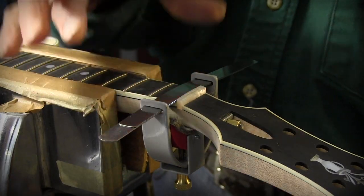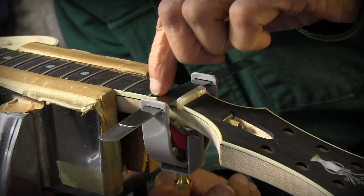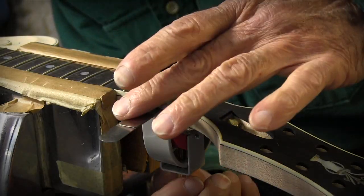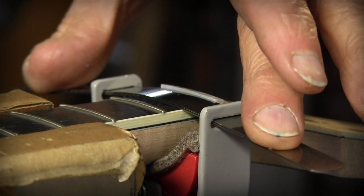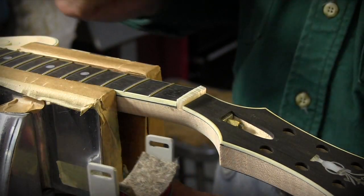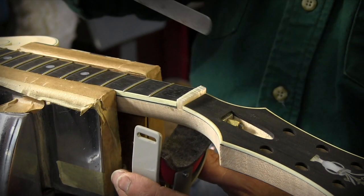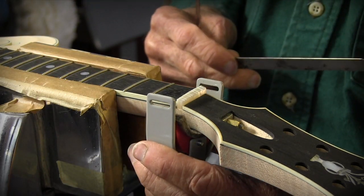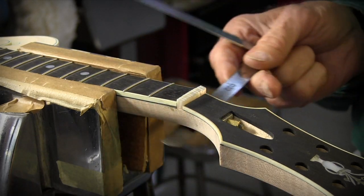Now I tighten down the holder, the tool, so that it brings the feeler gauge so it touches on the outer edge, but not so much that it humps up in the center. The tool has a slanted caul on it. Make that slant line up with the fall away of the peg head. It's designed to take care of the round that happens right at the nut.